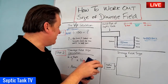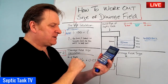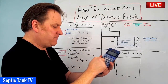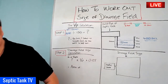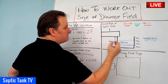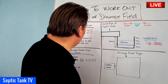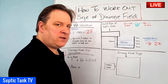Now we work out a calculation based on that drainage time. The drainage time (DT) is 4,000 seconds. You divide it by 150 — this is a government standard formula. So: 4,000 divided by 150 equals 26.6, which we round to 27. That gives us a VP figure of 27 seconds.